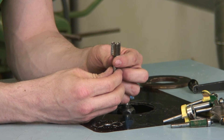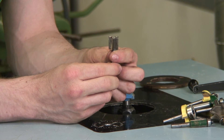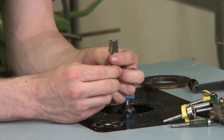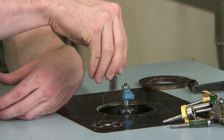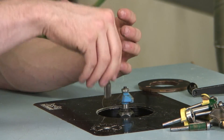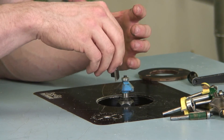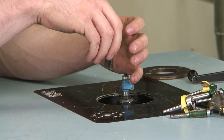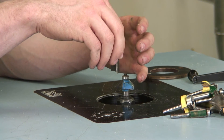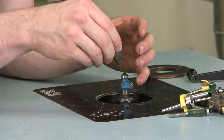This bit is another straight bit. It is made sort of like a drill bit — it can plunge straight into a board. It's used on a handheld plunge router. It plunges down into the board and then you can move freely, almost as if you're drawing with it. Or you can have a guide mounted to your router which follows a certain pattern that you may have affixed to your actual piece that you're working on.